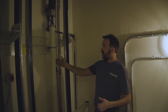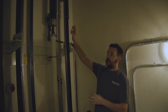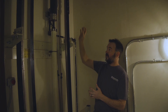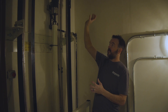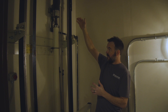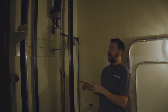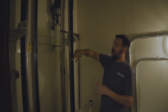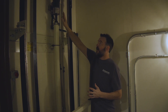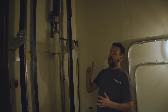So this is what we call a roped hydraulic. It's the cable that's actually attached to the car, but it's the hydraulic piston with the pulley that is doing all the work. It's pushing up to lift that car up, and as it comes down, the cable will come down along with it and allow the car to move. Because of the pulley action, we get a two-to-one ratio — for every foot that this jack goes outward, the car is going to move two feet.